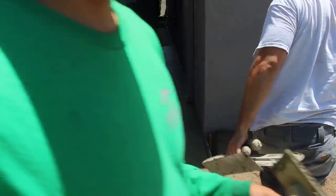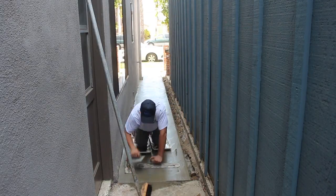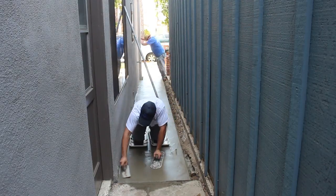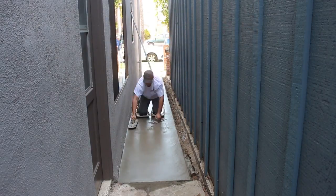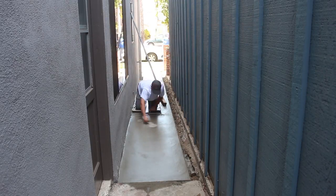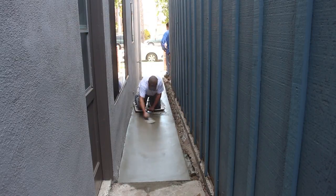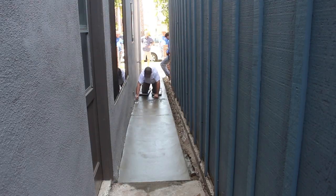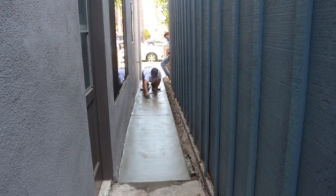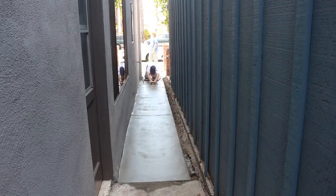We have a couple of round trowels — 16-inch, three-and-a-half to four inches wide. The round trowel is nice on at least one end because you don't leave a lot of trowel marks. I like to get one end rounded and the other end square so I can flip the trowel around and get the square end into tight corners where a round end wouldn't fit. Everybody knows you can't fit a round option into a square hole, so having both round and square on your trowel lets you fit into all types of spaces.